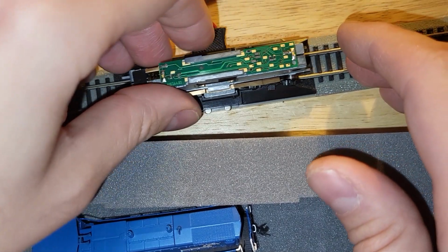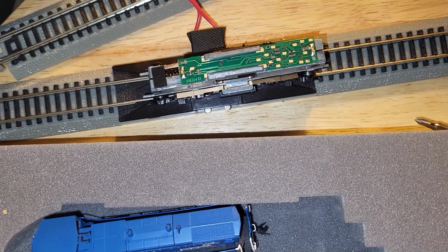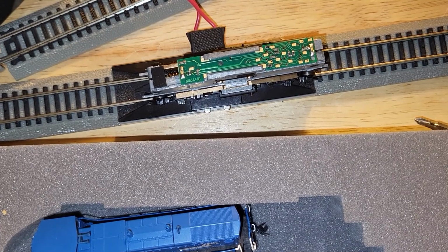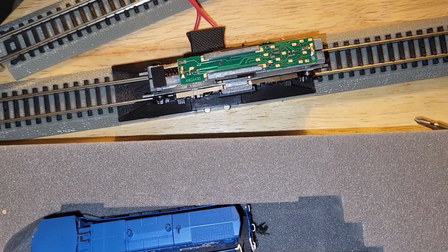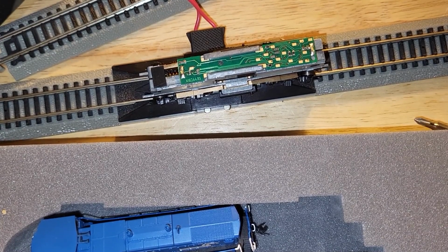It means the decoder, while it may have not failed yet, or is on its way to fail, or is pretty much dead now, you're just getting a temporary reprieve. God, I can't speak today, pardon me. Okay. Let's go to Program, Direct Mode, and let's go to CV8.